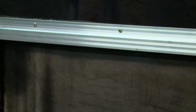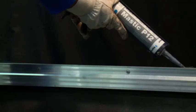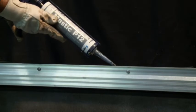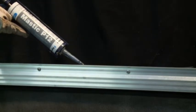At each head of the membrane, mechanical fixings are required at intervals of four pieces per linear meter. A metal strip is mechanically fixed at the head of the Terranap membrane. A bituminous mastic cord — Cyplast mastic P12 type — is applied at the top edge of the metal strip.